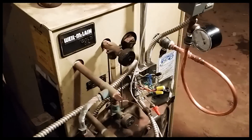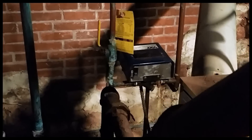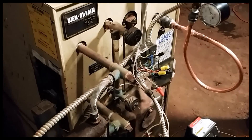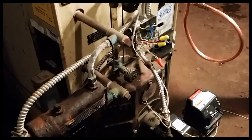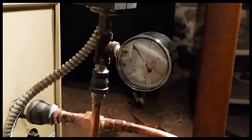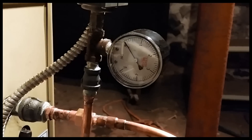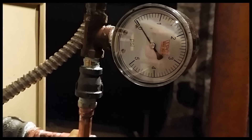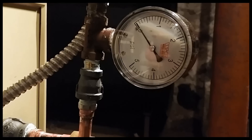But this is way more maintainable than the other one would have been, not to mention easier to fabricate. I have a mechanical union here so it can actually be pulled apart if need be. So we're just going through the issues that this thing is having one after the other, trying to diagnose them one at a time. The next issue we have to deal with is the water feed mechanism over here is old, and so is the low water cutoff. And it looks like we have some pressure coming — that gauge is dancing a little bit.